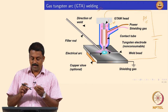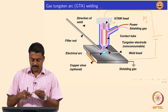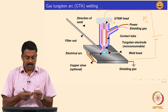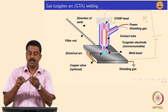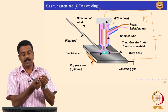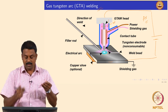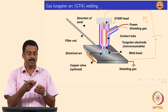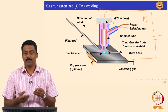Looking at the setup, we have the contact tube, and this is where the argon goes in and comes out. We insert the tungsten electrode so it comes out of the tip, and it is fixed to another assembly on top. We pass current between the electrode and the base material, send the shielding gas, and strike an arc — simple.